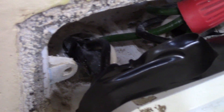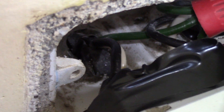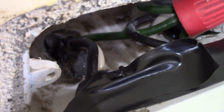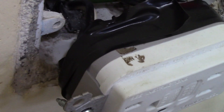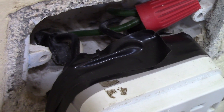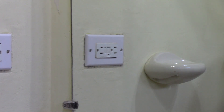Complicated by the fact that we only have two inches of wire pairs sticking out of each conduit, what I did was trim away a little bit of the conduit connector that was sticking into the box — carefully trimmed that with my side cutters, made sure the edges were smooth, then stuffed in a triple layer of electrical tape as an insulator inside that conduit connector. I also wrapped the terminal connections on this receptacle with about three or four layers of tape, and I'm going to remount the device as high as I can on those oblong slots so it stays away from those EMT connections.